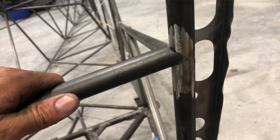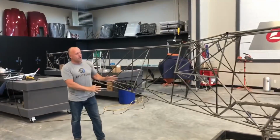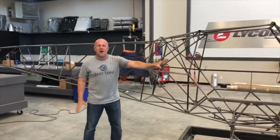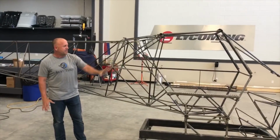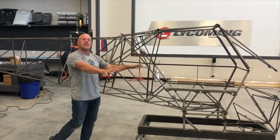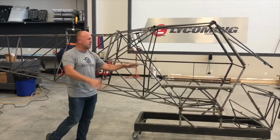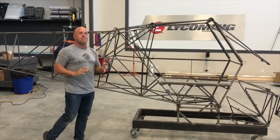Also, I've got to change the airframe itself. The back of this airframe needs to be reinforced. I'm putting the weight on the front, which the airplane can handle, especially the way I'm redesigning the front. However, I'm moving my gear forward so I can really hit the brakes, and I'm putting some really radical gear on it. I want to be able to stomp the brakes hard and not rock the plane up.